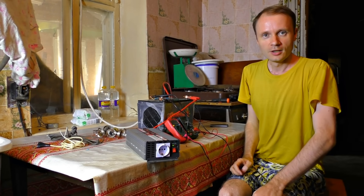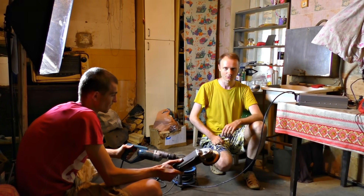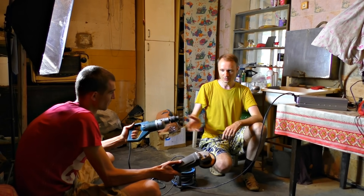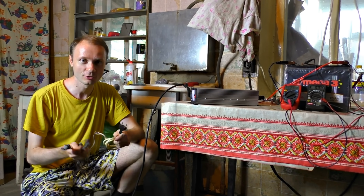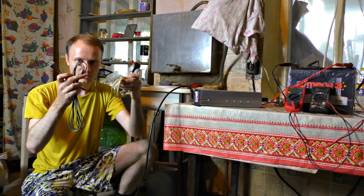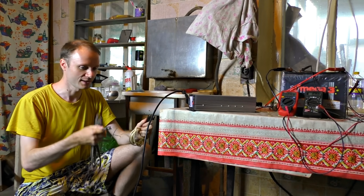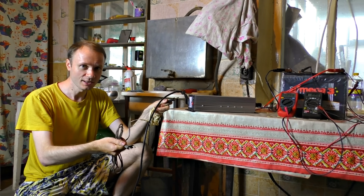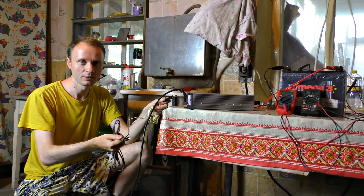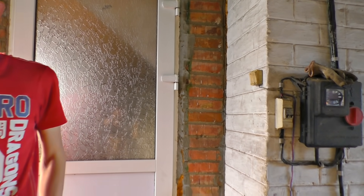There's energy — nice! Now let's try something very greedy for voltage. To make the dream of sourcing the entire house with green wind energy come true, I've connected two old TV forks — plug one end in the socket and another in the inverter. As a result, the voltage from the inverter will be connected to the house electric net. But first, you must screw out all the fuses and turn off the main energy lever to prevent any short circuits and disconnect the electricity provider.